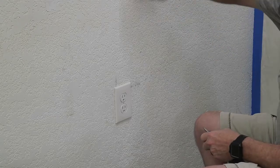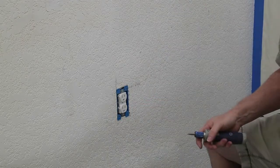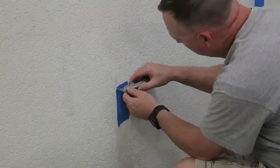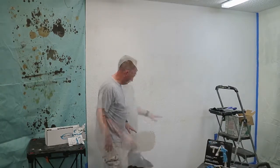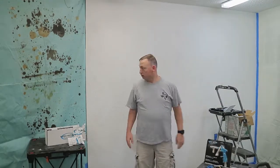Now that we've patched all the holes on the wall, we need to cover up this outlet. We're going to take the face plate off and put some tape on it. Always be careful if you're working around live circuits - don't get bit. We've got that tape on; now take a blade and trim it. The wall is prepped, all the little holes are filled with quick-drying compound. We've got the walls taped off, floor taped off, using all-purpose compound with my knives and damp rags. Now we're going to skim coat this wall.